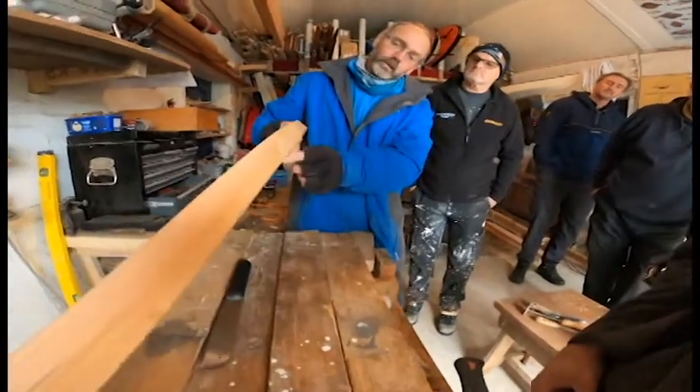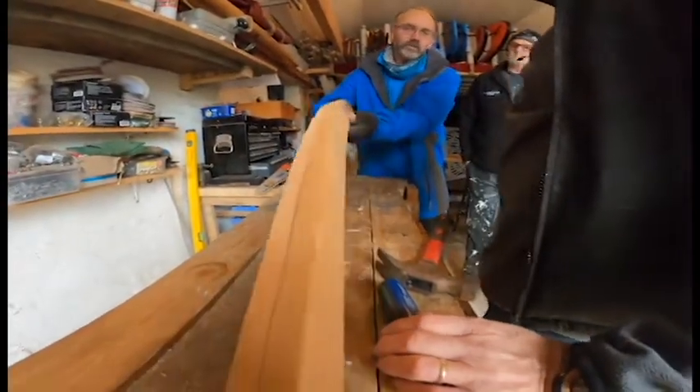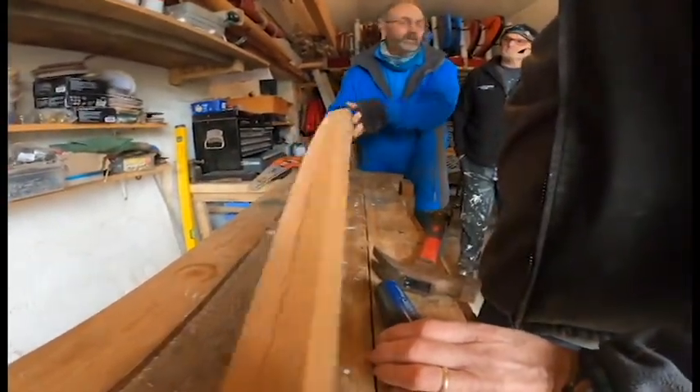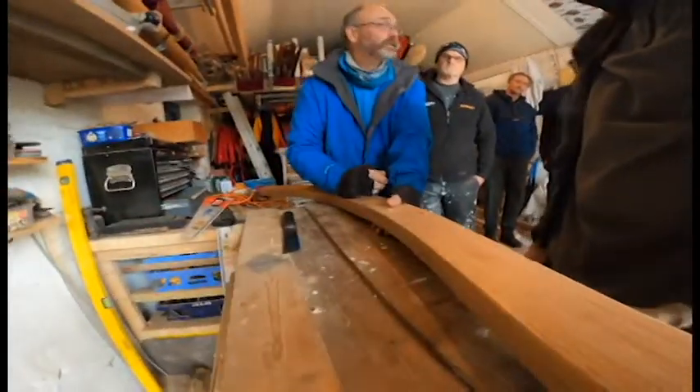If it's too far off the other end, it flips it over and cracks the other side. Tap the wedge in on one side, turn it over, tap the wedge in on the other side, and then trim them off. That's the way to get them.